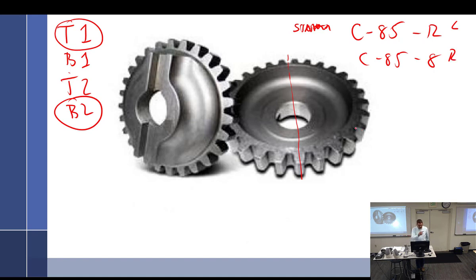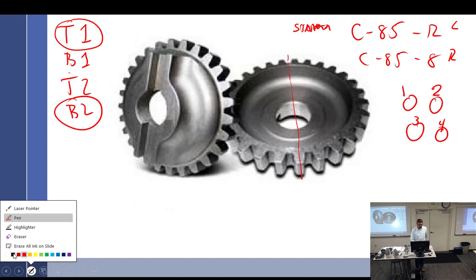So the correct mags were obviously installed, but the harness was wrong. They had got a harness for like a Dash 12. So if we did it like this, we'll say this is the first one to fire, that's the second one to fire, that's the third to fire, that's the fourth to fire. If it's a right-hand mag, hopefully you guys are following me.